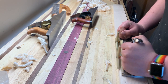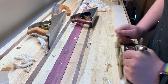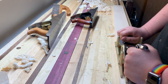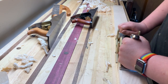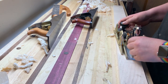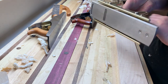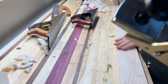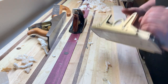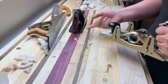Normally your plane's sole needs to be really smooth — that's why these are smooth. Do you hear that? That's like sandpaper. Now if I just put a little bit of weight on it, like if you were trying to flatten a piece of wood — do you see how jerky that is? I've actually learned that this plane's surface has gotten scratched from doing this. It's not a very hard surface, at least not compared to those.